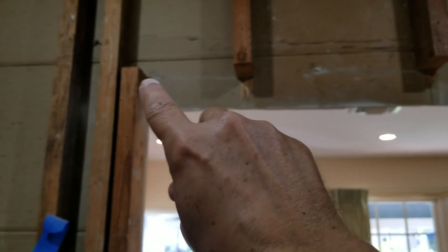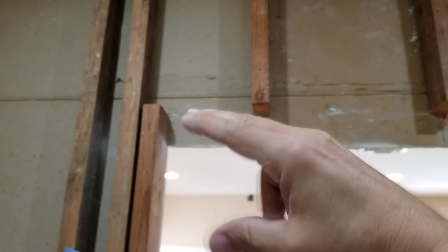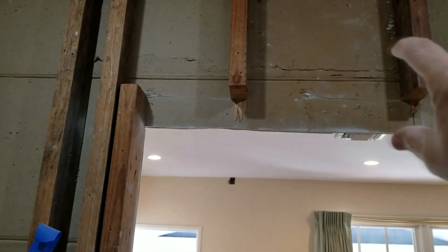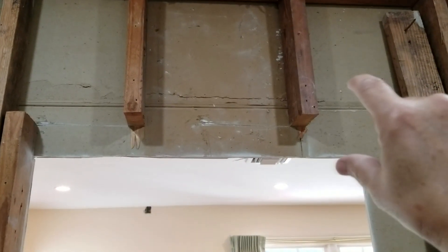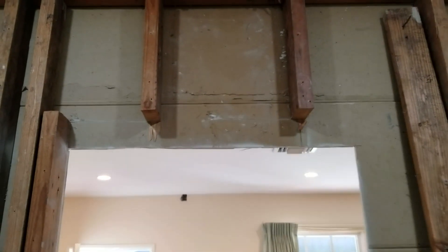We can use a two-by-four or a two-by-six. It's not load-bearing, but usually if it is load-bearing, I prefer to rotate a couple of two-by-sixes so that it'll be six inches tall but stacked two boards thick, to give you really good strength. But this is not a load-bearing wall, so we don't have to worry about that here.